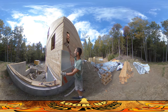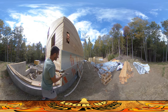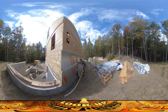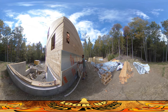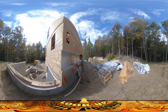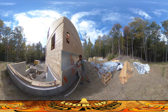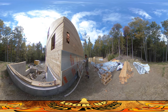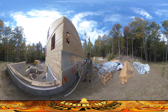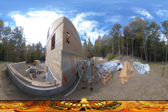What's behind this is the post of the wall, so this is going to go into the post. I don't like to sink any of my nails until everything's pretty much lined up - make sure the height is all good. That looks good. So I'll do the next one and push it straight in through the foam. I just continue that right along the wall. I've got all the pieces pre-cut and ready to go up. So the workflow is: spray foam, drop them in, and then retain them with these nails. I'll sink the nails once I get the whole run in. That's it - thanks for watching.